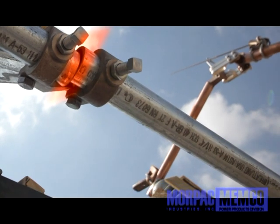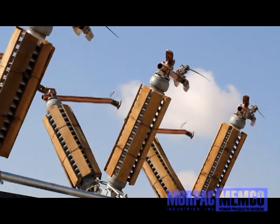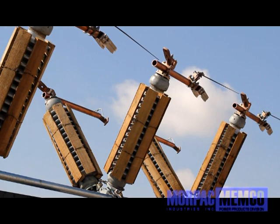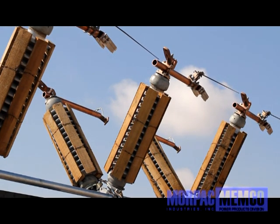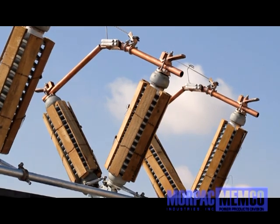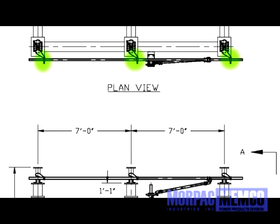Make sure you leave enough of a gap between the two pipes that meet at the middle phase in the hinge double clevis, so that the action of opening or closing the phases does not jam the two pipes into each other. This was originally designed to compensate for any misalignment between the phases which may occur on wood structures. If you have a single pipe installation, then simply slide the pipe through all three clevises of all three phases.